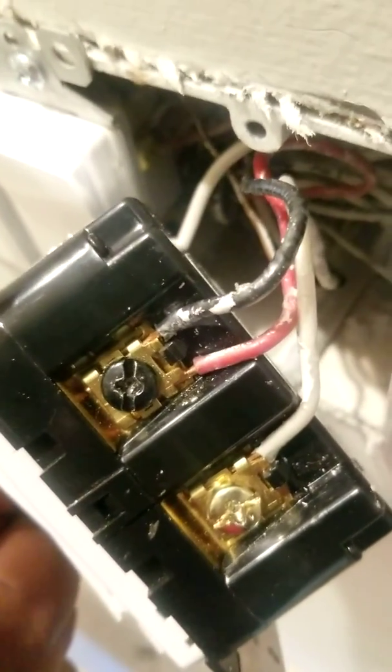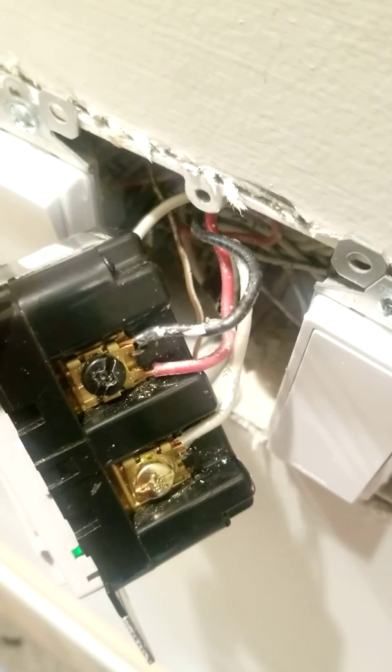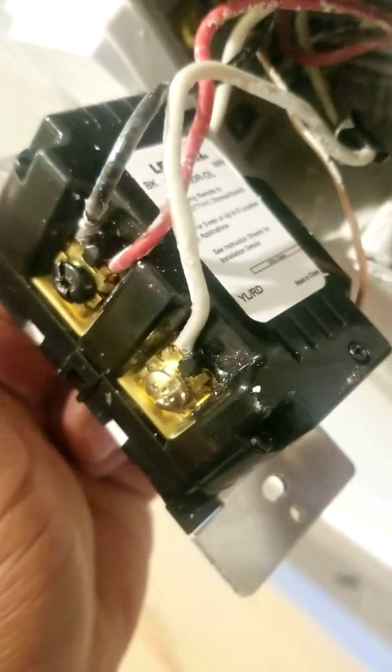Once again, this is a raw video. That black wire you see — this is the remote side. That black wire is my line-in coming from my breaker box. I'm doing this for demonstration purposes — my electrical box is on and it is hot right now so I'm being careful. That black wire right there is the line-in, and that red wire is my second traveler wire.